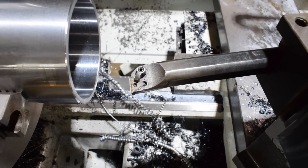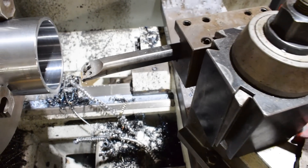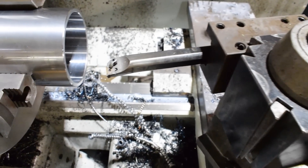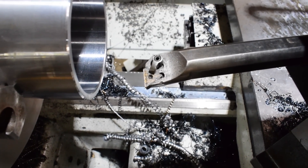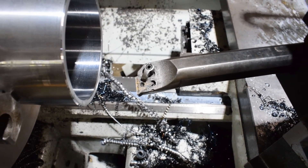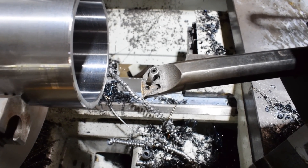Like I said, it's a lot of work, but I also enjoy doing it. So the next step here is to actually cut a grease groove all the way around - it's going to just be a shallow, basically a very coarse thread. I've done a lot of these over the years, and the thing I use is this triangular insert, but I have to set my tool post at an angle to get that just right. And basically all I'm going to do is a very coarse thread through there. This is going to go fast, and if not, well, we got two tries to shoot it.